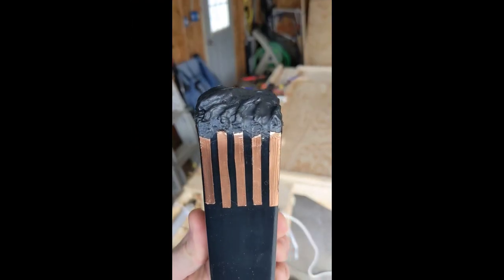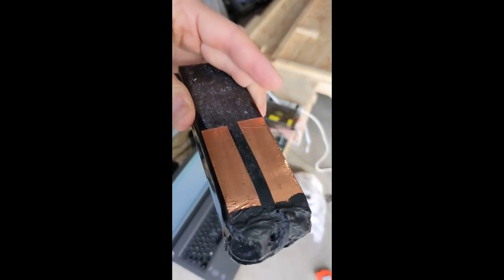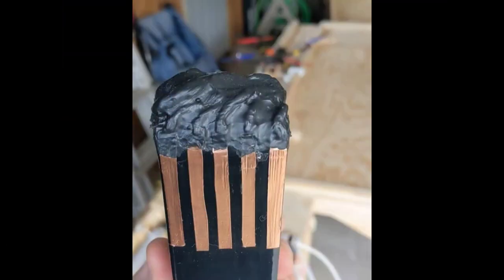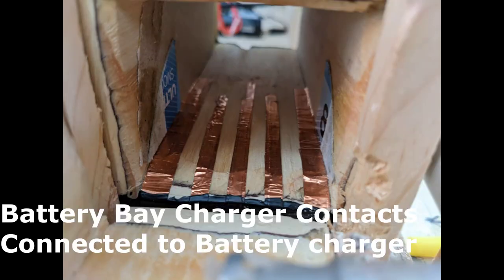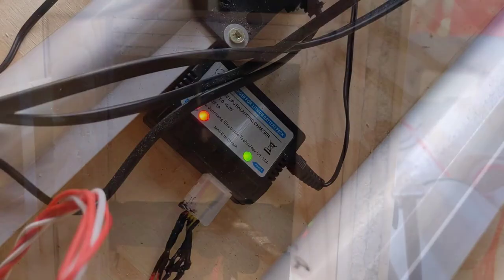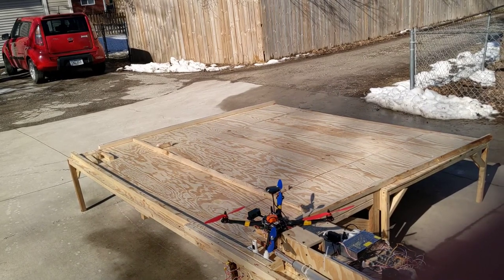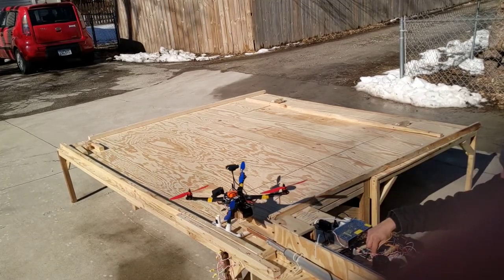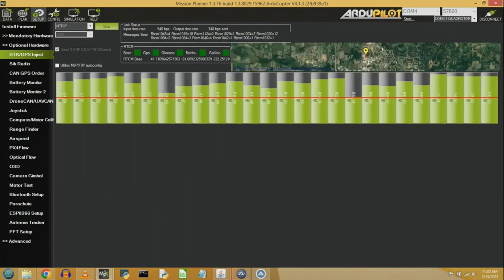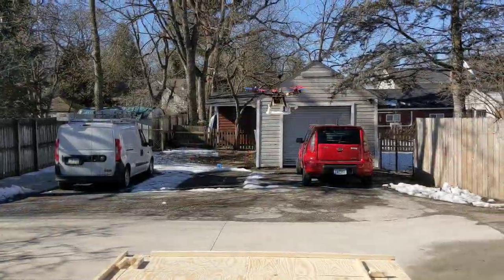The spent battery is pulled back into the now-empty battery bay to begin charging. The batteries have been modified so their contacts are exposed on the outside of the case — the top two large leads power the drone, and smaller leads on the bottom are used for charging. Both sets of contacts connect automatically when the battery enters the drone or the battery bay. Once the drone is refueled, the landing pad bars retract, a linear actuator pushes the drone clear of the swap equipment, AutoIt takes back over, loads the next mission, and the drone takes off again — repeating the cycle.